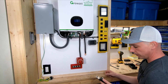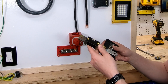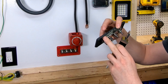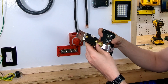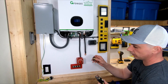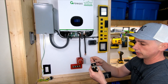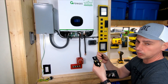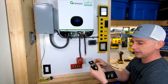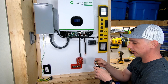For my negative wires it's going to be a little bit more tricky. You can see this shunt is too big and it's going to press up against the top here. So I put these bus bars in and that's going to get me off of the bus bar. This is just like a little mounting plate for the — I believe it's a 500-amp shunt. I'll never hit 500, but I think it goes 100, 200, and then 500, something like that — I couldn't get a 300.